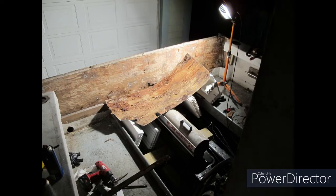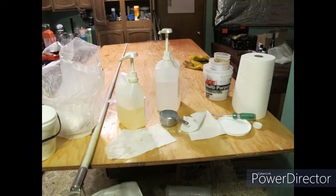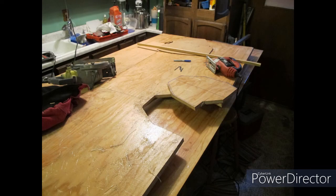Here you can see the cavity where the two three-quarter inch pieces of marine plywood transom fit into. So now it's time to start making the transom. I bought some marine plywood, encapsulated it all in epoxy and fiberglassed it over. And yeah, that's in my kitchen because it's cold outside.